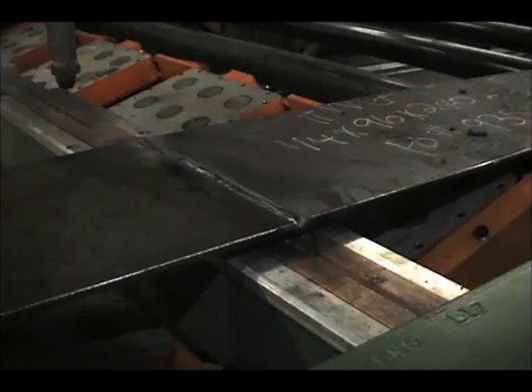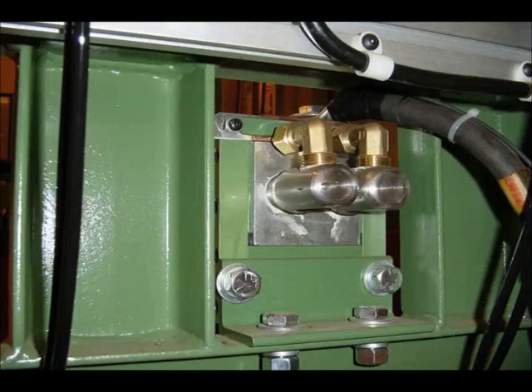The copper backup plate is easily removed and rotated or replaced. It is mounted in a T-slotted clamp design on top of an aluminum subplate that provides a four-pass cooling system.